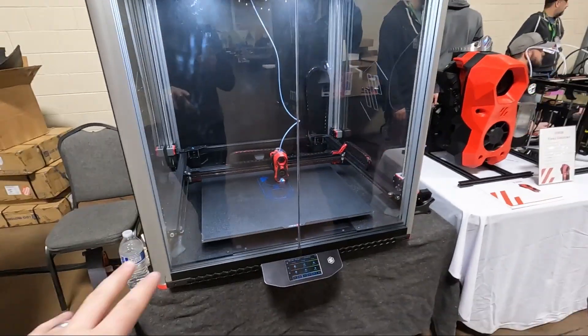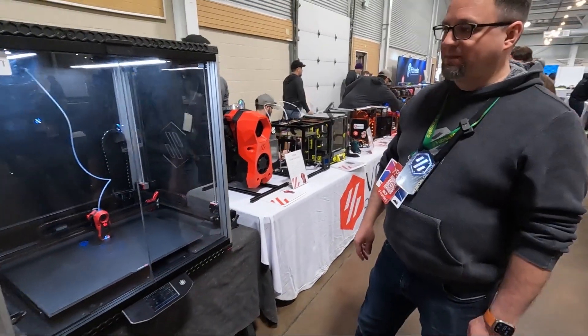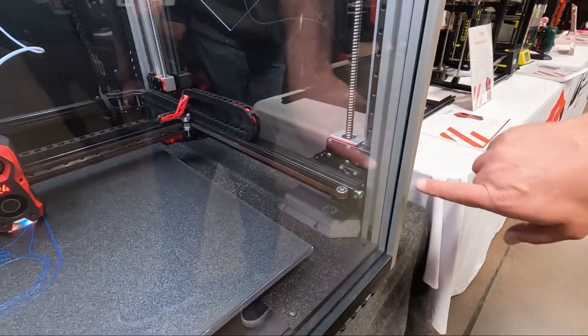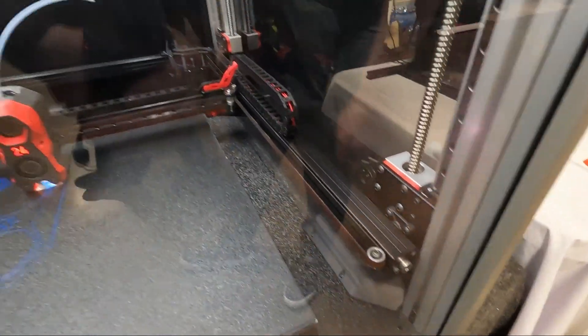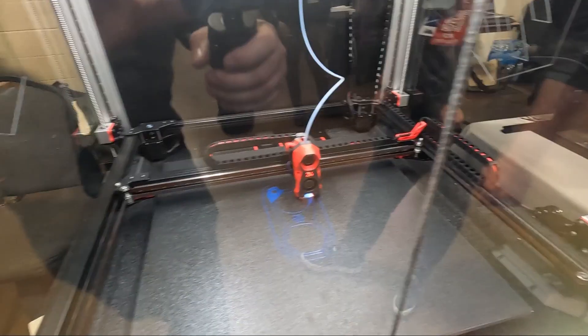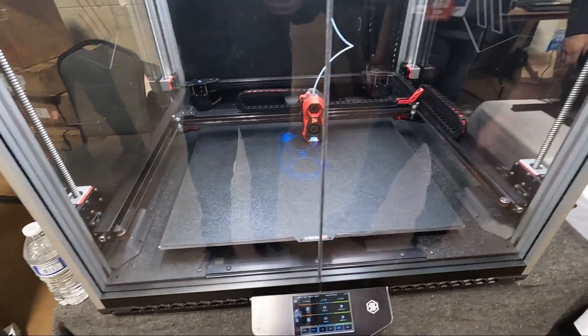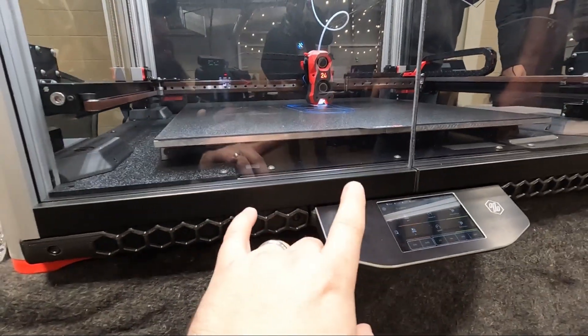So what's different with R2 versus the original? It now has ball screws instead of lead screws, independent carriages on ball joints on each of the four corners, and all the motors are NEMA 23s. It has four individual beds underneath — four individual 300 millimeter beds.